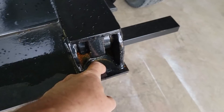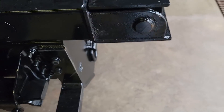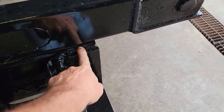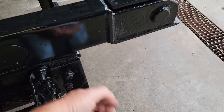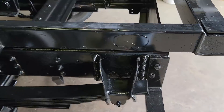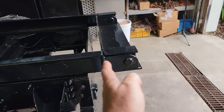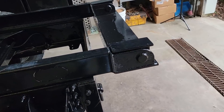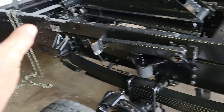At the back, they want you to drill a hole to the top of the frame and bolt it in. I have to compensate for that with this half-inch or five-eighths plate here, so I have to set that bolt hole back this far. If I had more frame, I could have set the bolt past the hitch plate, but there just wasn't enough frame. So I have to shorten this up a little more — not really the end of the world. With an electric or hydraulic hoist, we'll have slightly more overhang than most dump trucks. Our bed is ten-foot-six, so we'll be hanging over about seven or eight inches with a gap up front.